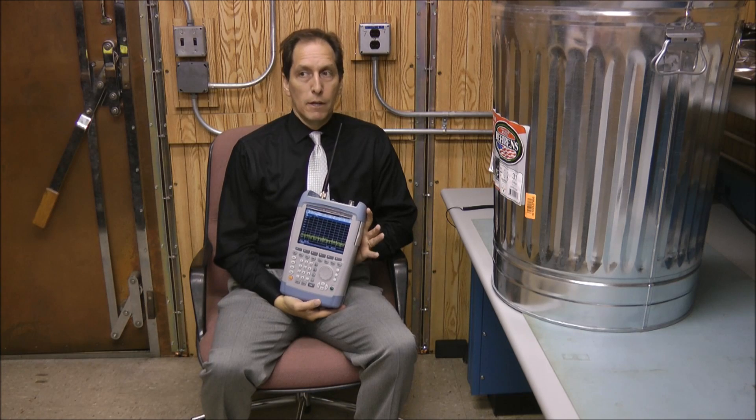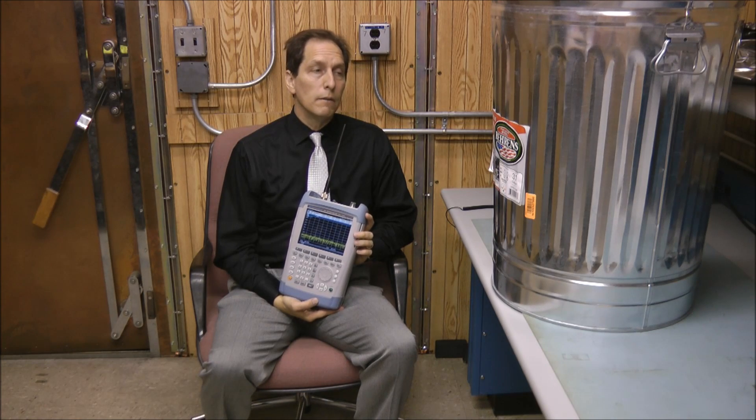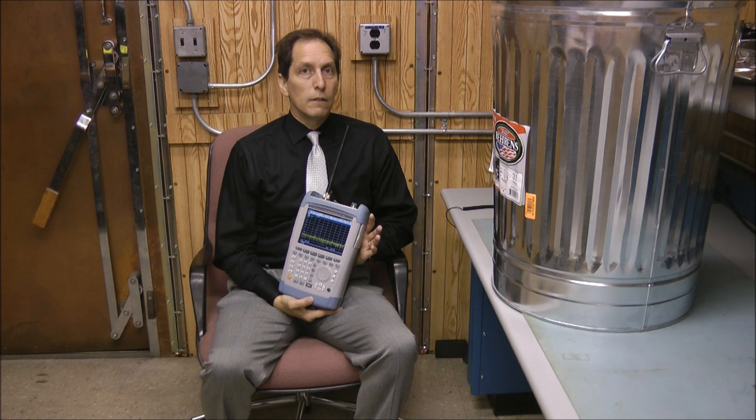Now that we've talked about the test equipment, let's talk about the test procedure. The first thing we're going to do is turn on the transmit power and set it to a specific frequency. Ideally for an EMP we would span several frequencies to cover the broadband range, but for today's test I'm just going to pick a single frequency — 500 MHz. We'll do an open air test first with the spectrum analyzer sitting on the chair to get a baseline reading. Then we'll turn off the transmit power, put the spectrum analyzer into the Faraday cage, turn the transmit power back on, and see what the levels look like inside. Comparing those two measurements tells us how much shielding the Faraday cage offered.